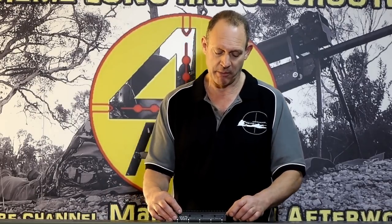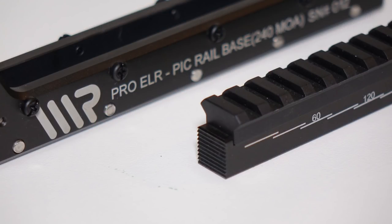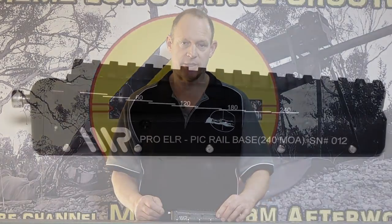What it has is a V-groove in the front — I'll put some images on so you can see. There's a V-groove in the front of the lower block and a nose that pushes into a point, so it's always going to be located exactly by the nature of the mechanism. At the back it has multiple grooves on both the top and the bottom sections. You get it to the V-groove you want by looking at the lines on the side, then push it forward with a little Allen screw. Those multi-grooves locate themselves very precisely with the points lining up, which means you get lots of increments in a locked-up fashion that repeats perfectly every time.